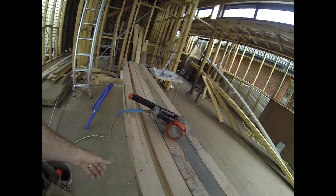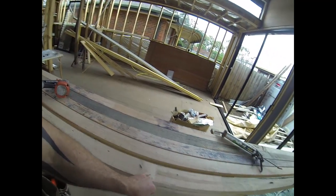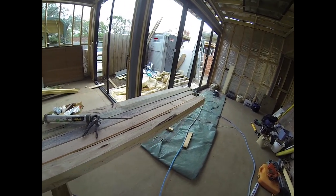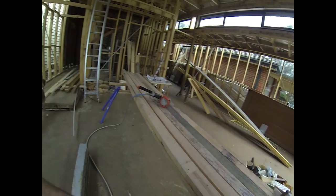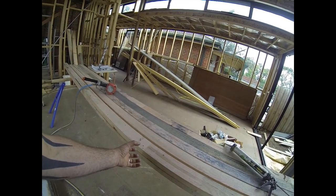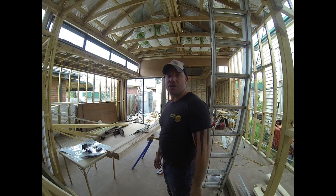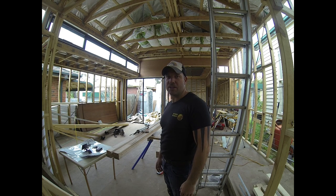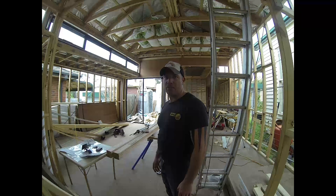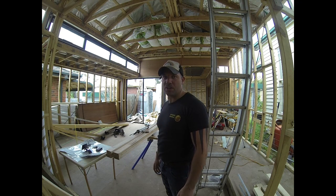Once we've done this whole piece of timber on this side, we'll flip it over and do it all again, then run across with bugle screws and chuck bugle screws in about every 450 centers. That also squeezes it together and holds it in a good spot, and stops it from separating over time. So we've got all our timbers laminated together, nailed and glued, bows opposing, nails opposing — all of it's together and we've just finished cutting our first bearer to size.